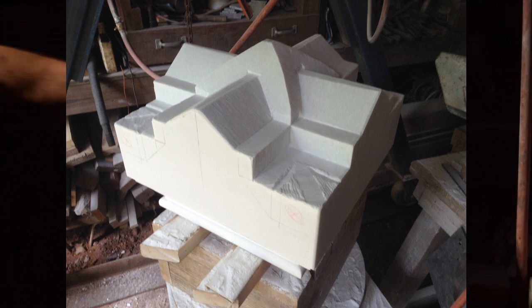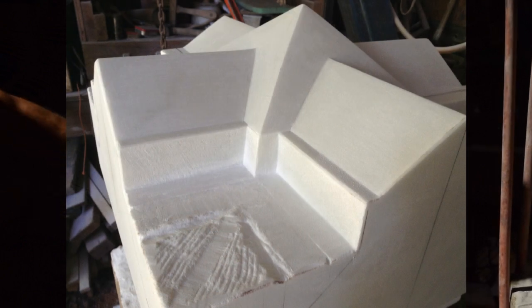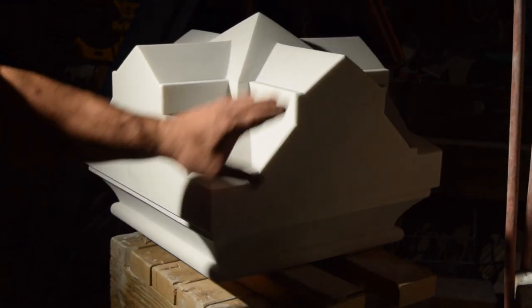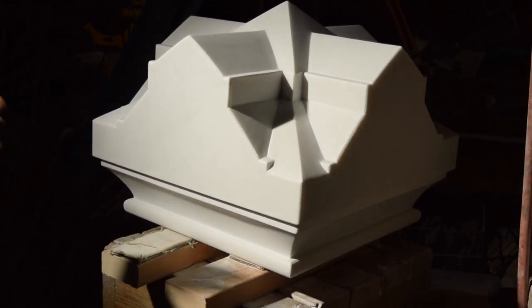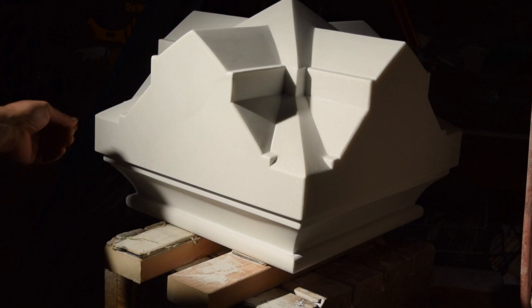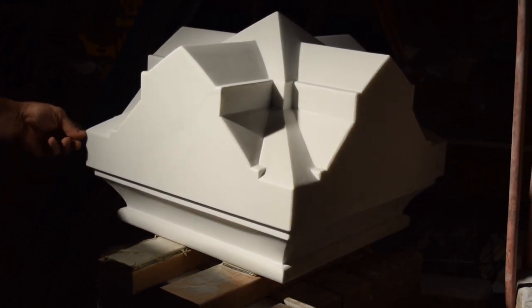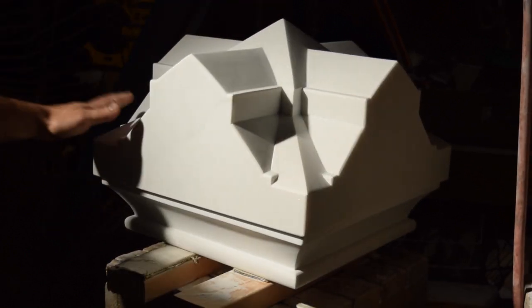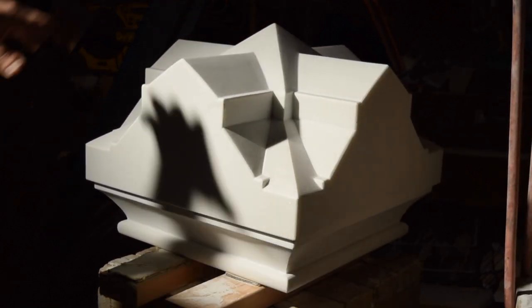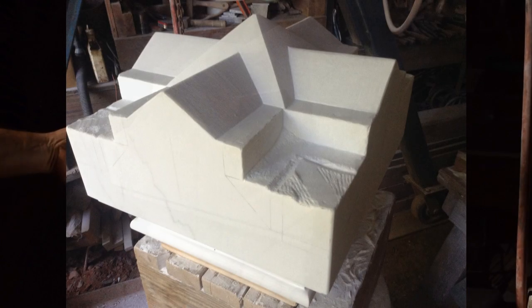After this was all done, we started lowering these, lowered the centers first, and you do one area, and then you do the next one, and you do the next one, so that everything matches. And that's in case there is a problem and you have to shift something, because if this chipped and I had to go down an eighth of an inch and I already had three of them finished, I'd have to fix all three of them. So you do everything methodically around and it actually produces the job faster and it's more accurate.